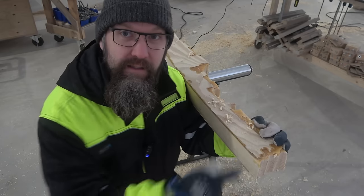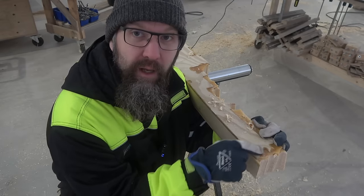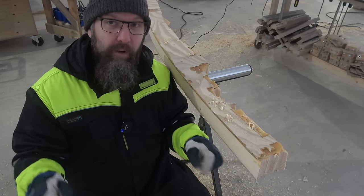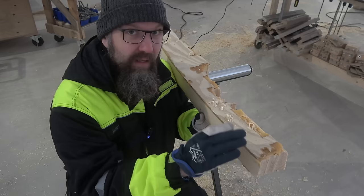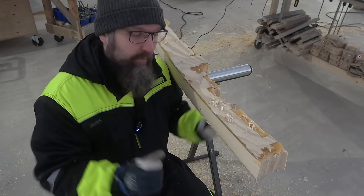One little detail is the shape you can probably see here, this slot in this plywood. I need to make that slot to fit those bulwark pieces on the floors. That way these frames will locate themselves exactly where they should be.